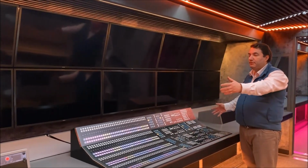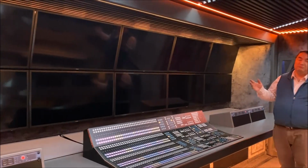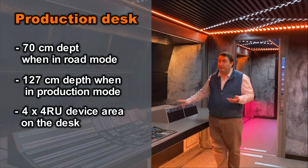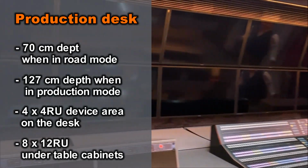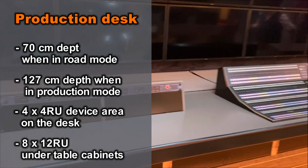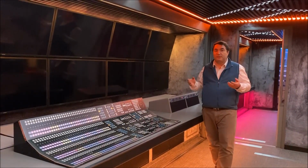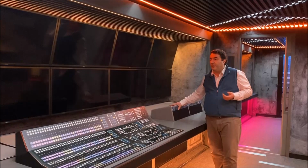We specifically kept the center area as large as possible so that if you would put a, I don't know, 36 cross point, 32 cross point ME panel, it would be wide enough. And on the two sides, we have each four over-the-table rack units with 4 RU height, and actually a nice 25 centimeters depth. So even if you have some maybe audio monitors or things like that that are slightly deep, like maybe TSL or some other products that are 10-15 centimeters deep, you can still easily house them here.